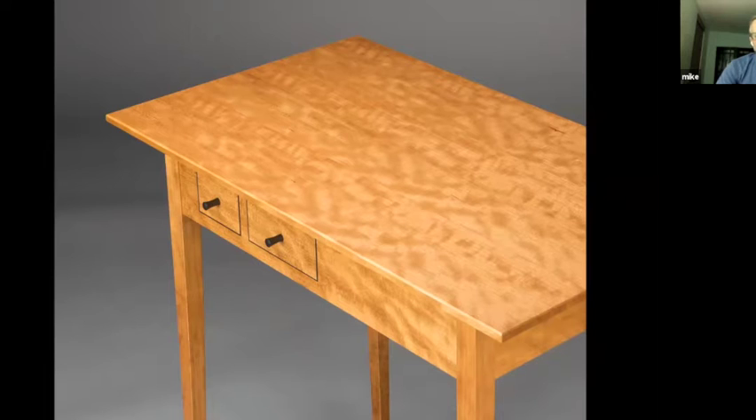To hide that glue line I ended up doing a pretty heavy chamfer on the top edge. I talked about chamfers a little earlier — I use chamfers in all of my work. Probably 95% of the individual parts in my work have some sort of chamfer on them, just to soften an edge or to provide a facet that reflects the light slightly differently. In this case I employed that detail a little heavier than I normally would, but I was trying to hide the glue line between the veneer and the substrate.